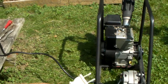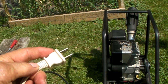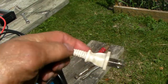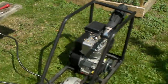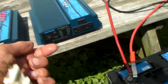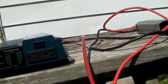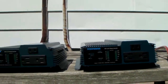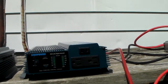What you can do is get a decent extension cord and hook up one of these ends on the other end. Turn off the power to the house by turning off the circuit breaker downstairs — I mean the entire power to the house, turn it all off. Then you can plug one end into your inverter, and the other end you plug into your 120-volt socket in the house, so that everything on that circuit can be powered. You can just plug whatever you want into it and there you go — you don't have to run extension cords all over the house.